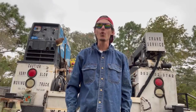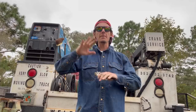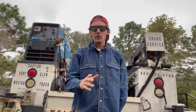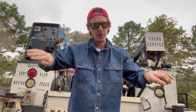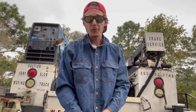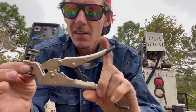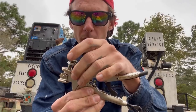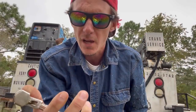This brings me to trick tool number five. This one is something I bet some of you pros don't even know about. It's this little doohickey I got right here in my hand. Every once in a while you get into a situation where you don't need to clamp something together, but you actually need to spread it apart. It's happened to me several times and I thought, they've got to make something out there. After a decent amount of research, I found this little guy. This here is a spreader clamp — you can adjust it and then lock your nut down wherever you're at. I've used this thing on several occasions and I keep it in the truck because you never know when it's going to come in handy.